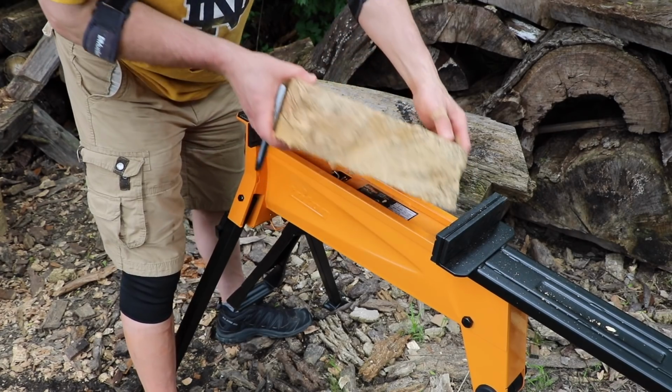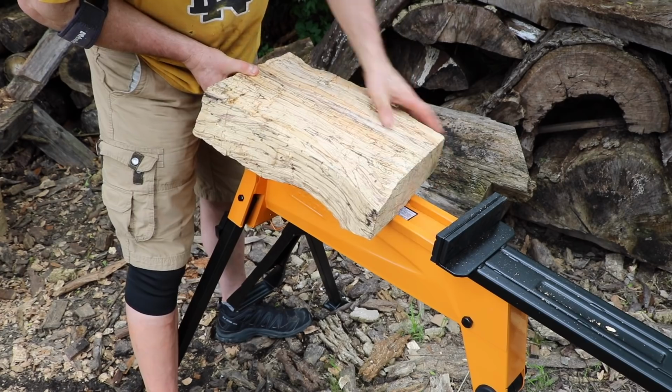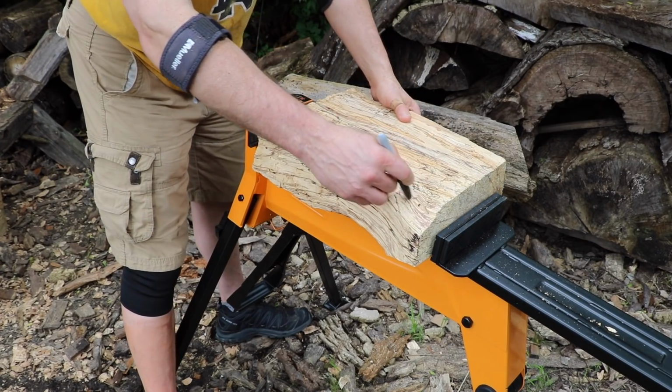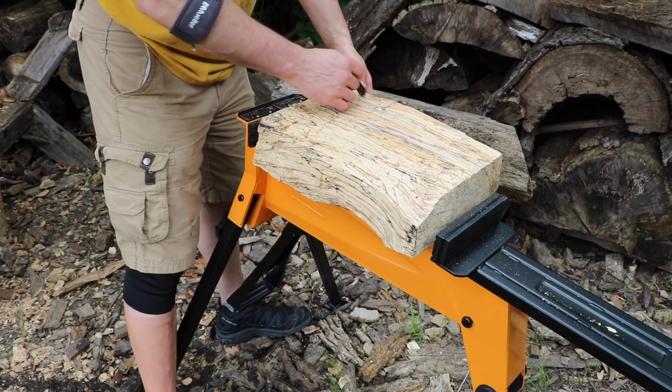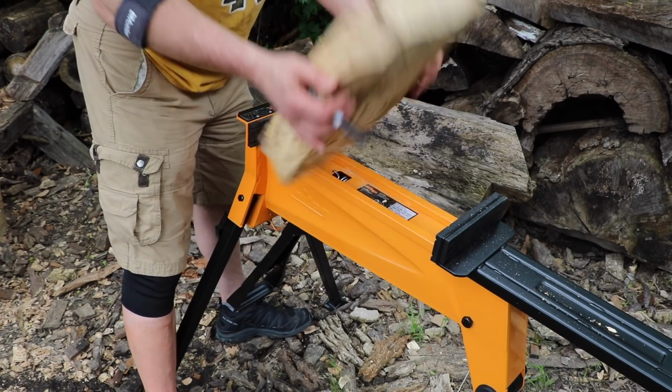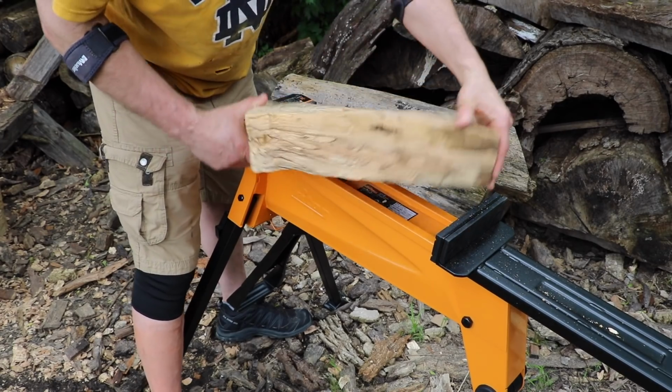And these corners are in pretty bad shape. The wood is very powdery. This is already broken off. So I'm gonna round the edges here. Try and use as much wood as I can, but round the edges to take those corners out of play. Then again on the bottom, I'll angle this in and that'll take out this piece that's missing and that big bug hole.